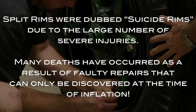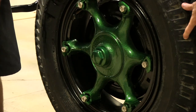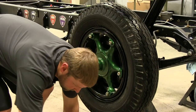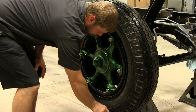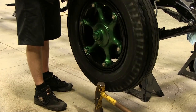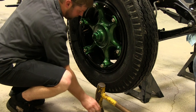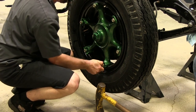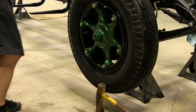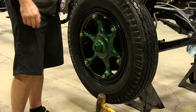Now we've got them all started, we have to true this thing up and make sure we get it nice and smooth so the driver doesn't get shaken to death. I use my hammer and I'll start about an inch from the wheel and spin it just to see how bad it is. I find the highest spot that sticks out, bring the hammer a little bit closer, and tighten the wedges a little bit at a time. Then I grab a socket and an impact and snug them up gradually until it's nice and smooth.